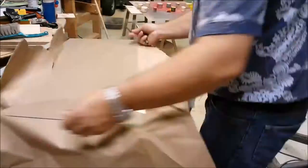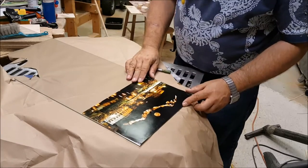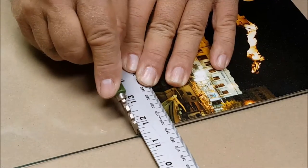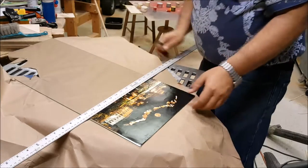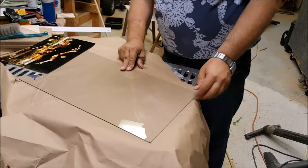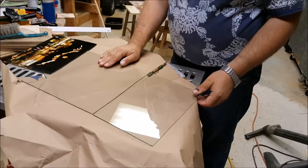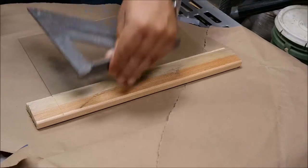Time to have some fun! Please, if you are afraid of cutting glass, have a professional do it. Cutting glass is very easy — your cutting bit should be very clean and very sharp, and you do one nice pass. You use the back end of the bit, line it up right in the middle, make that nice thin cut, and give it a light tap. Simple as that!